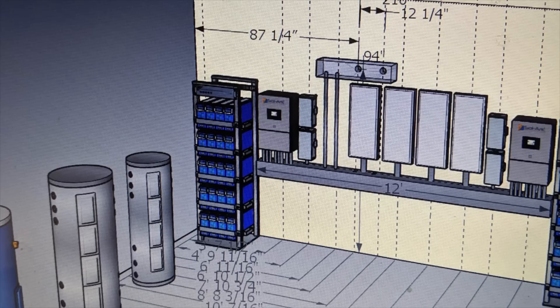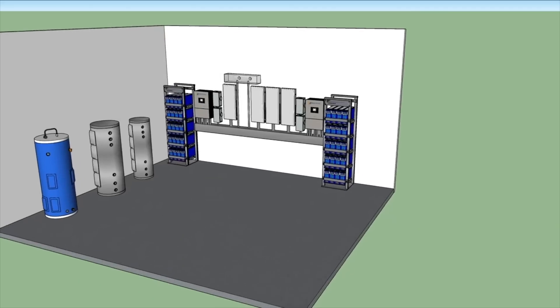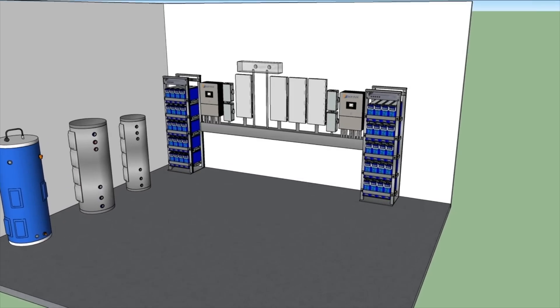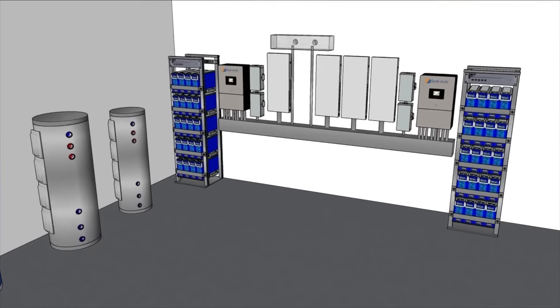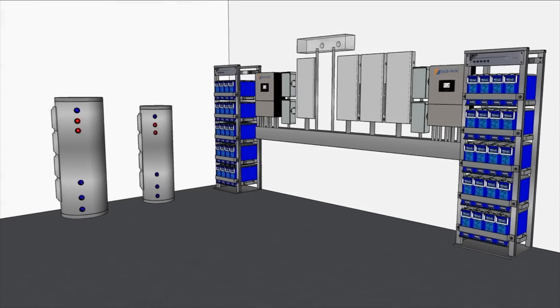My overall goal is to run this house — about 4,000 to almost 5,000 square feet — on less than 50 amps of power. Even though he has a 400-amp service, I think we can run everything: heating, cooling, lights, refrigeration, and well pumps under 50 amps, which is unheard of. Every motor, every compressor is soft-start or an inverter-type motor/compressor — that's where most energy goes in a home, starting up those large loads.